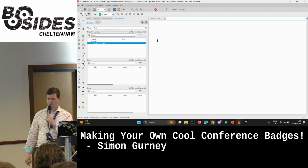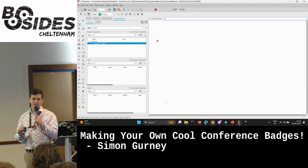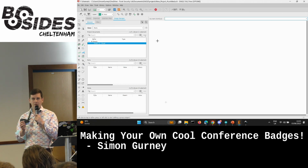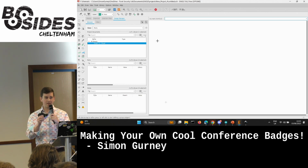So you've got an idea of what you want to do. In this demo, I'm just going to do a coin cell battery with 2 LEDs on it. So that's pretty much the simplest circuit you're probably going to make for a badge. These have an internal resistance, so you don't need to put a resistor on. Again, angry engineers will tell you that you should definitely put limiting resistors and all those things, but I always advocate for the least parts possible because you're probably going to solder these things.